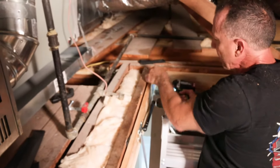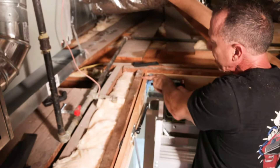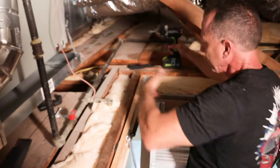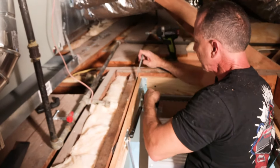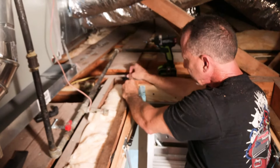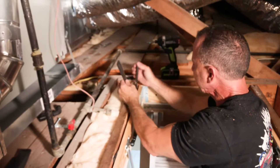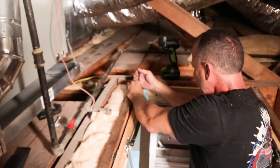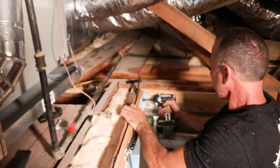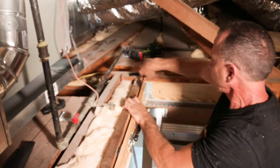When I'm snugging up here you see I have a little gap — that's where I want a shim. I run it in to where it just touches. It doesn't even have to touch; when it gets close I can take some shims and slip them in here and get it just tight. Once it's tight, snap these shims off. I like these shims that are corrugated looking — they snap real easy, some of the best shims I've used. Now it's nice and tight. Snug it up and you'll see how easy they are to snap — they just pop.